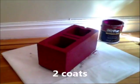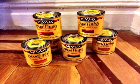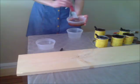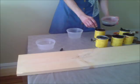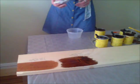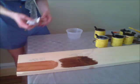Now moving on to staining the boards. Say you couldn't find the exact shade of wood stain you had in mind — there isn't nearly the amount of variety in wood stain as there is in paint. One might be too yellow, another not red enough, or one that's way too dark. What you can do is mix any of the colors to get the one you want. A good trick to ensure accurate measuring is to use eyedroppers. Start with several units of the lighter shade, then add the darker shade bit by bit so it doesn't overwhelm the mixture. Test it on the back of the board to make sure you like the color, then remember the ratio so you can reproduce the exact same shade in case you run out. Don't forget to wipe off the excess stain so you get the best idea of how your new color will really look once it's dry.